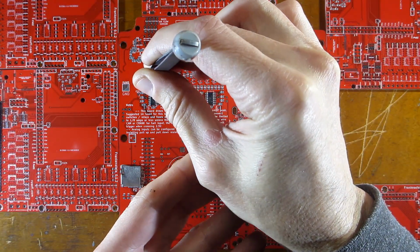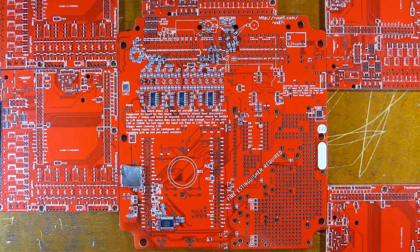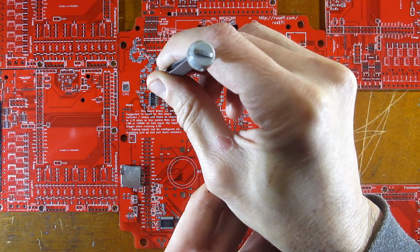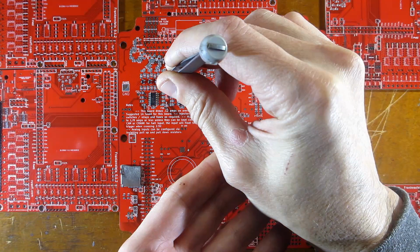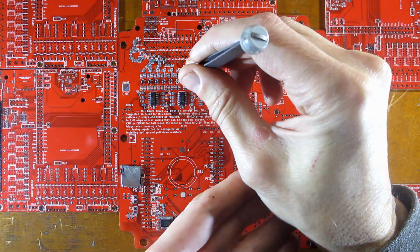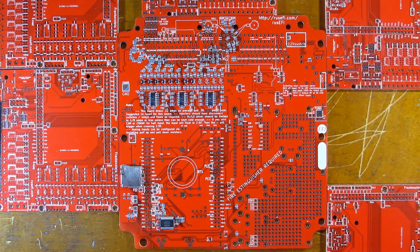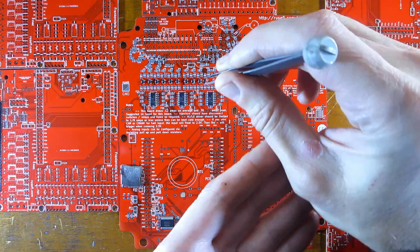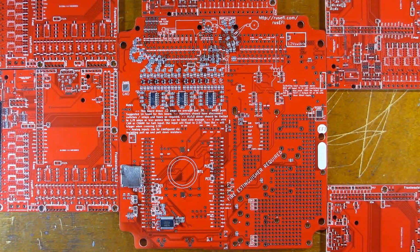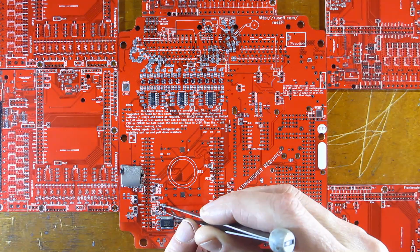Fit the double Schottkys, or the BAS70s. I should have really run a soldering test with these things hanging upside down to see if there was enough surface tension to hold it in place, but I figured the pads were so small that there wouldn't be enough solder to hold it upside down. Either way I didn't take the risk because I didn't want to do it twice, so I used the glue anyway. There's also one down here that I nearly missed.